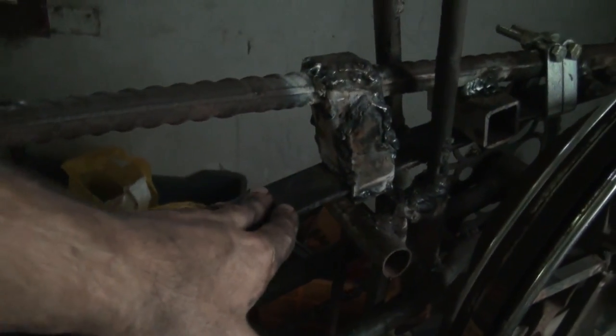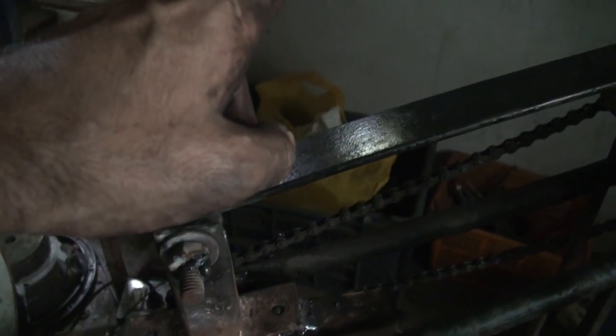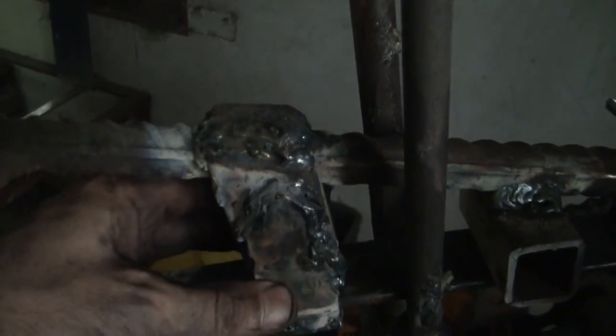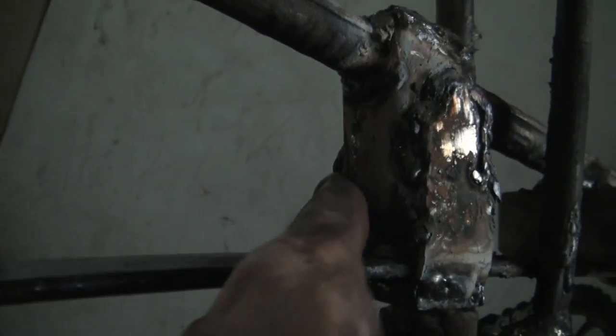And then I found that at that speed it was a bit floppy. It was going up and down, but every time the cam was going up, the hammer wanted to go down, if that makes any sense. And that was making it very juttery. So what I did is I also welded a box on here and then welded this whole contraption on there to really make it solid. The spring is actually freely running through. There was a box section here, I welded it onto another box and then just welded it all together. So this is loose, but it's strong enough.